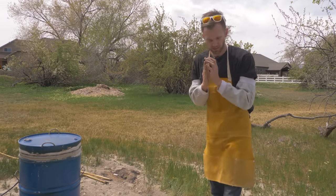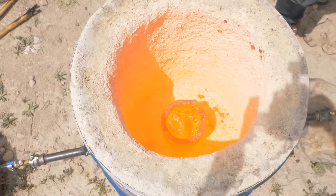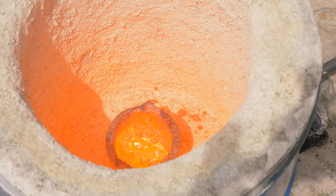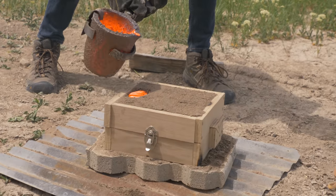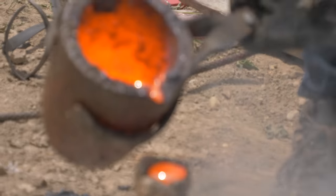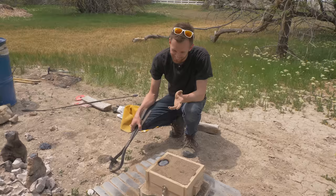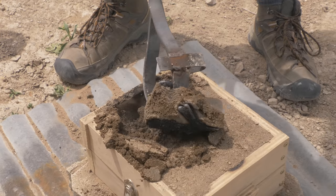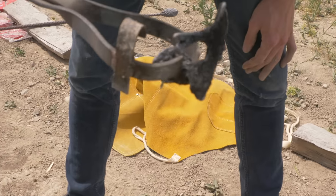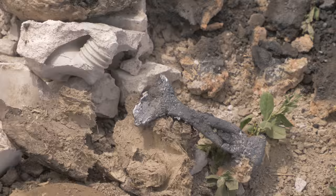We should have some more nice molten iron. Turn off the furnace, move the lid, lift out, place down, pick up, pour. Some of it's liquid — I don't like that chunk that isn't melted; I'm concerned it's not iron. The rest looks pretty good and liquid. We'll attempt a little slag removal and hope is all we can do at that point. It's not going in very much at all. Moment of truth — I think more went in, but not all. I can see the handle and the very beginnings of a pan.